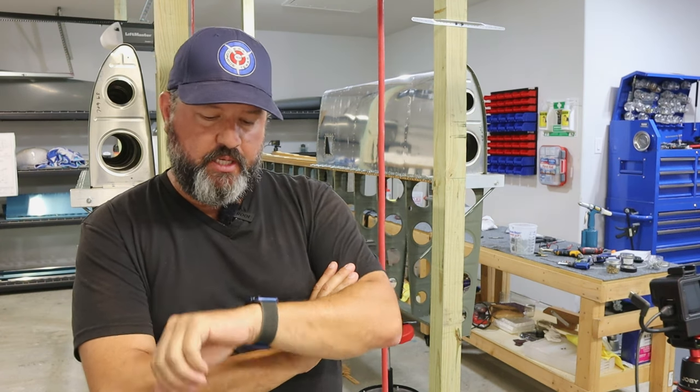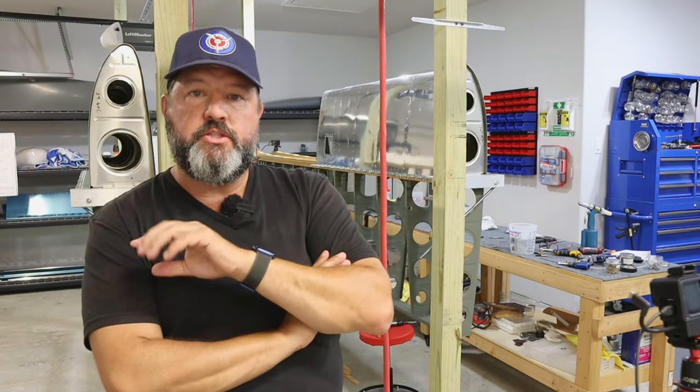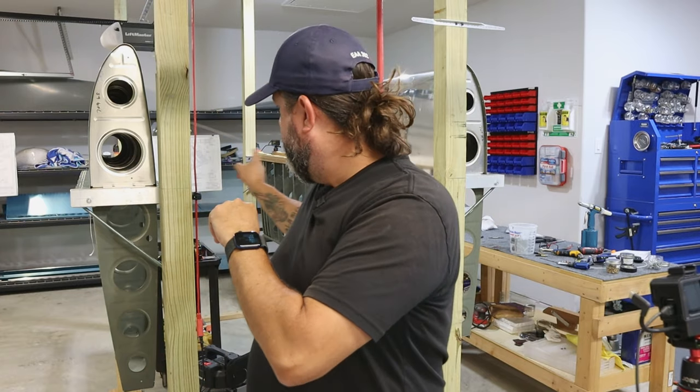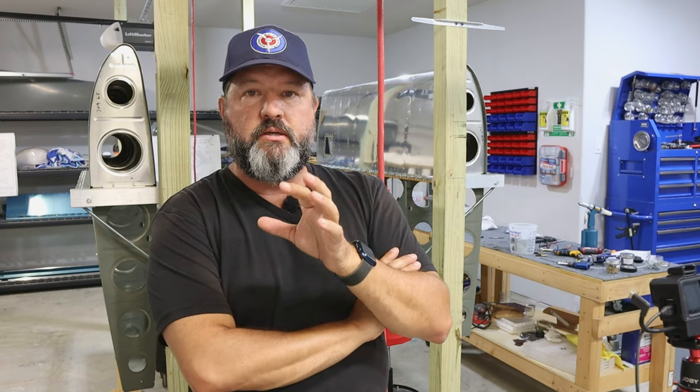Welcome back to the Gilbertson Aero Factory. Today is Saturday, August 26th, 2023. Going to continue work on attaching the leading edges to the main spar. I can't complete it fully - I've got some other rivets and a little tool I need - but I can get the inboard and outboard ribs done and all of the skin-to-spar flange rivets done. It's pretty toasty here in the garage even with the AC going; it's like 107 outside.